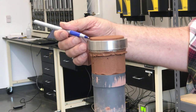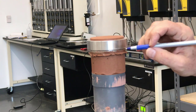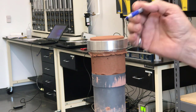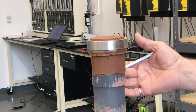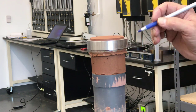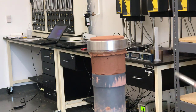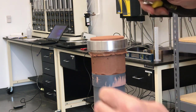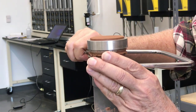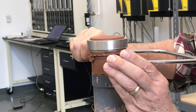When I'm through trimming the ring into the Shelby tube sample, I'll have a little bit of soil extruding out of the top and some extra trimmings at the bottom. Those of you with eagle eyes will notice that this isn't the same specimen I started with earlier — I'm using a specimen I'd already trimmed into the ring to make things a little faster. The next thing I'm going to do is cut the excess sample off of the bottom using a wire saw, cutting about a quarter of an inch below the bottom of the ring.